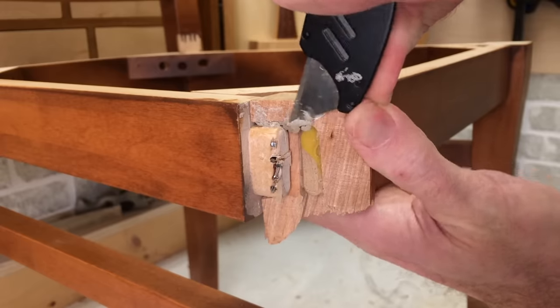What I do is heat up the wax stick with a candle, which softens it and makes it much easier to apply to the surface. You can see it saves a lot of elbow grease — I heat up the stick and rub it in. It hardens pretty quickly, and with the wax cooled I come back and clean it up with a putty knife, then rub it down with a cloth. This large filled area is underneath the chair and you're likely not going to see it, but I want to make it as invisible as possible. I'll pull up the touch-up markers and touch up all the areas.